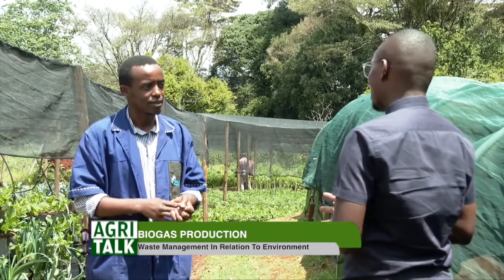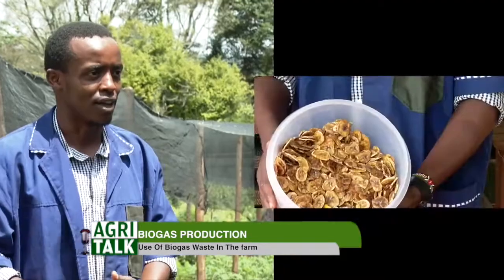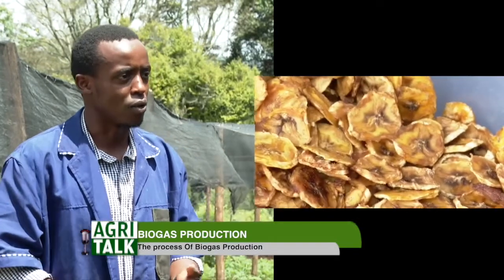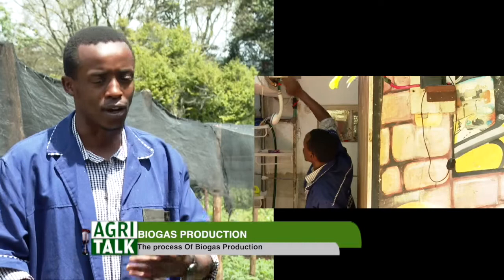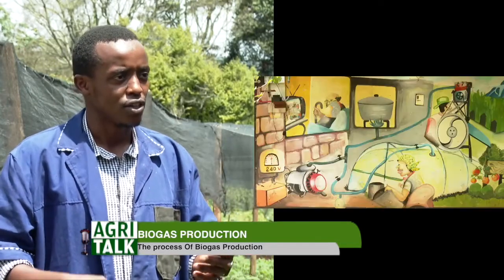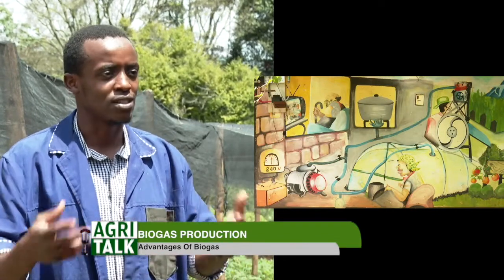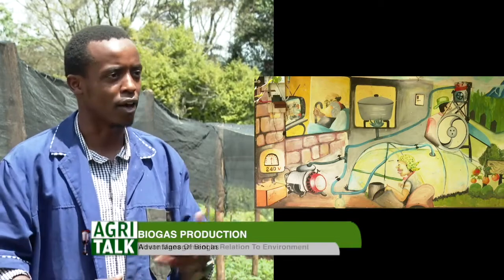Now the double burner stove, what is its importance in such a process? A lot of people know biogas is for cooking, so the stove comes together with the biogas digester, because that's how you get to utilize the gas. But biogas is not just a cooking solution. You can do fruit and vegetable drying, water heating or showers, and run machinery like a chaff cutter or generators. There are all these appliances you can run with the energy. We say biogas is just the same as your other regular energy forms.